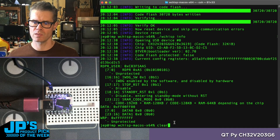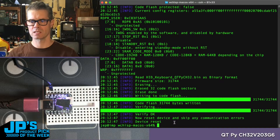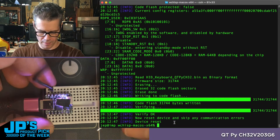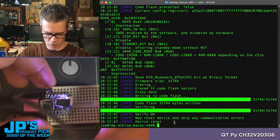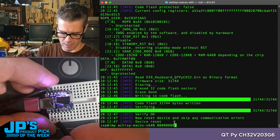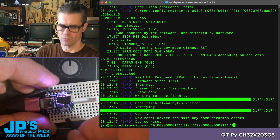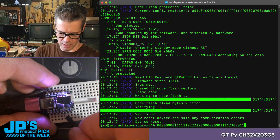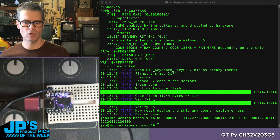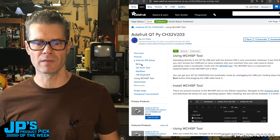Now I'm going to flash it with an HID keyboard example. Very quick and easy to flash once you've compiled it. Now if you watch my command line, I'm going to use this jumper cable to touch pins A0, A1, A2, and A3, which are working as buttons to type HID keyboard input. This will just type 0, 1, 2, 3 — so A0, A1, A2, A3 are acting as buttons. Here are a couple of the examples I was using — NeoPixel tells you all the libraries you'll need, and it's standard NeoPixel code for Arduino.